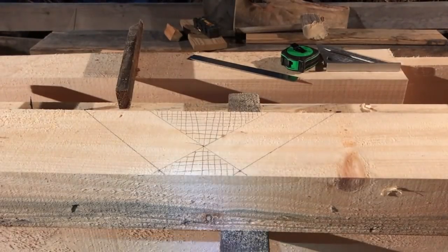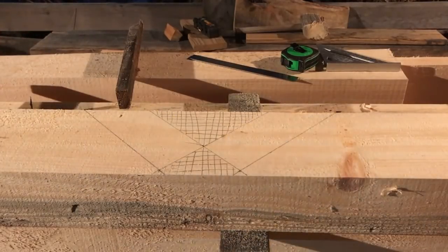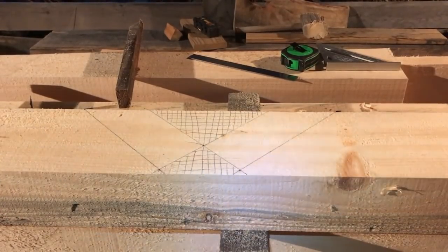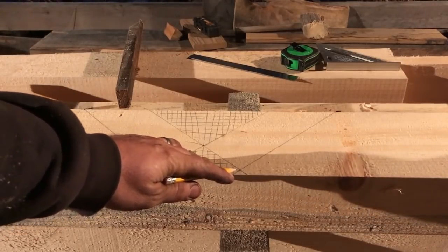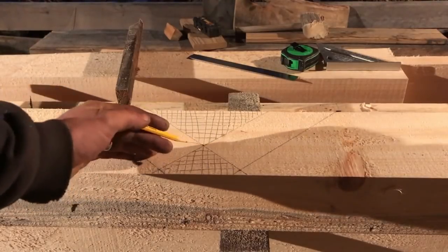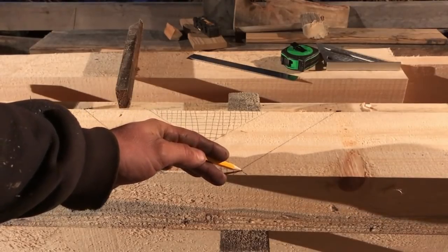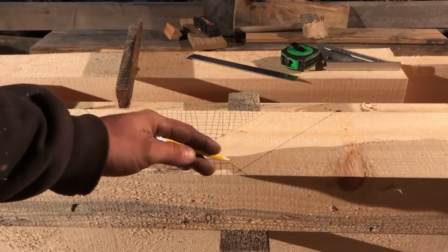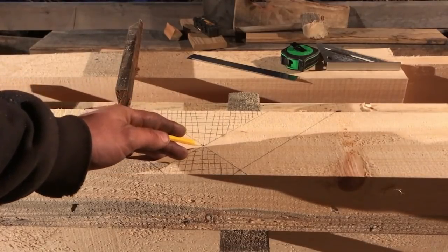Okay, on a particular note of interest, if you lay these out end to end like I have here, you're going to have to plan your cuts out a little bit differently. All right? So, I'm going to turn this headlamp off. When I go to cut this, I'm going to lose 1/8 of an inch or thereabouts from the saw blade kerf. I don't want to cut down here first, and then I'll end up cutting this brace 1/8 of an inch short on one end. If I were to do it on both ends, we'd be losing 1/4 of an inch. I'm not worried that this thing's 2 7/8 long. That's not going to hurt anything.